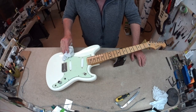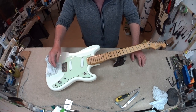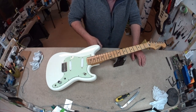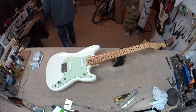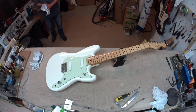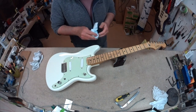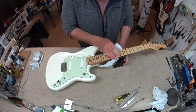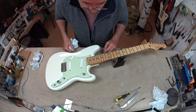The only guitars I've ever had a major problem with in the past in losing their finish have been Fenders, American and maybe some Mexican ones. There seemed to be a period of time when they had a problem with the finishes not adhering to the wood. So long as you never got a chip or a break, it tended to stay together. But as soon as you leveled the frets and put a piece of sticky tape of any kind on it, you found it just flaked off this finish.